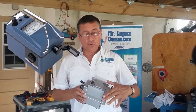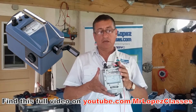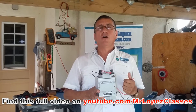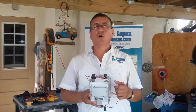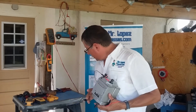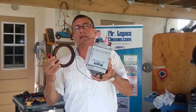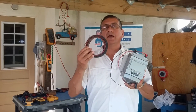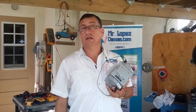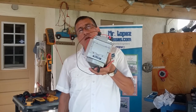Another important equipment is the megohmmeter. With this equipment, measured in mega ohms — millions of ohms — you can check the integrity of the back end of a generator, or the integrity of any AC or DC motor. This equipment is used to check how is the insulation of any winding — windings of a DC motor, AC motor, back end of generators. Any winding can be checked with the megohmmeter.